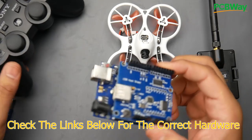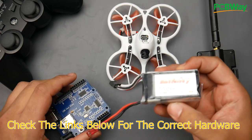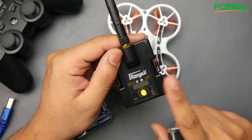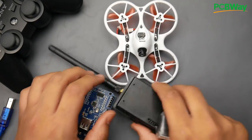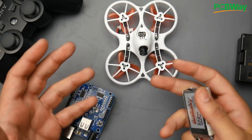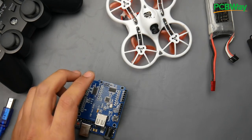All you need is the USB Host Shield on top of the Arduino Uno, two wires, and an external 3S LiPo. The reason for the external 3S LiPo is that the multi-protocol modules need six-plus volts to boot — they won't run off the five volts from the Arduino. Let me show you how to set this up from a hardware perspective before going into the code.